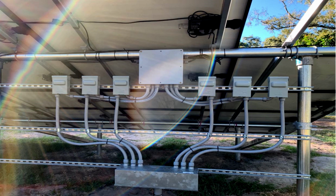On top of that, you've got all the wire management underneath there. You've got a giant combiner box, and there are 6 strings on this one, and each one of them has to have a disconnect. From there, all those strings are in a trench, and on this job in particular it was 320 feet-ish. I think it was 317 to be exact. So that's an extremely long trench.